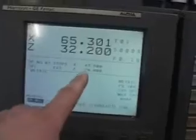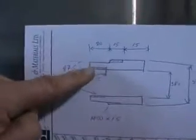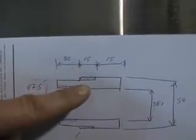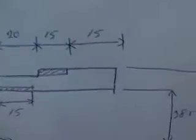Cut number 2. Operation number 2 — the next one — we're going in 20mm and we're cutting to 47.5mm. That's that diameter, 47.5mm going in 20mm. And that's so I don't have to thread the whole 35mm in. That hatched area there is going to be threaded.